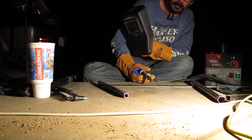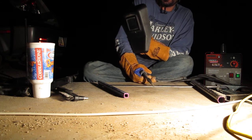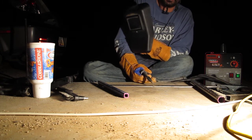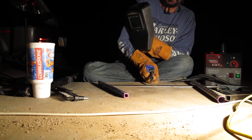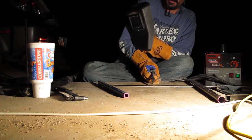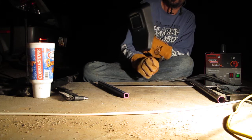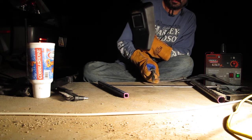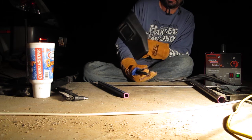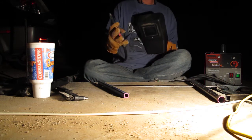The most important thing is to keep it consistent. As you strike the arc and try to keep it going, you're going to see the puddle building and hear the sound of it, and you're going to realize you're in the sweet spot — you just have to maintain that angle and move back. Unless you're welding up and pushing a puddle when you want to go deep, you need to be moving back otherwise you'll end up with big old cavities. Enough of me talking — let's see if I can remember what I just learned over the past hour.